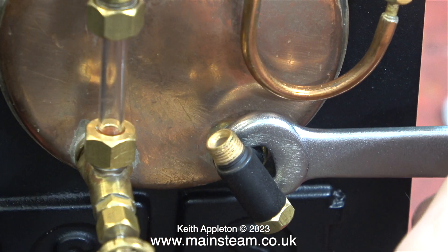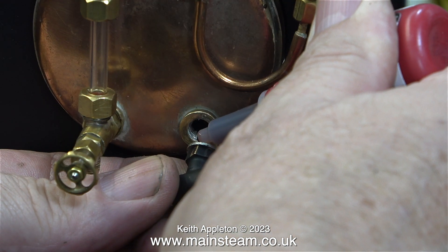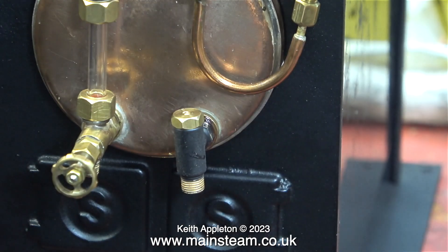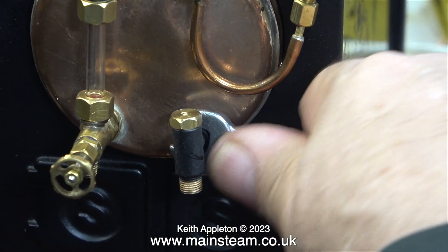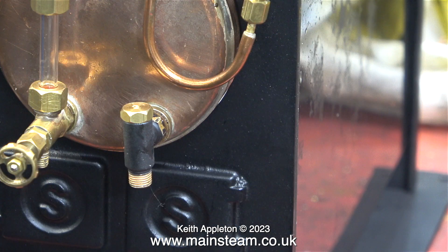I tried a test fit in the boiler using the new check valve but it didn't end up in the right position. Here's the hole in the boiler where the other check valve was and you can clearly see some remnants of the last Loctite 542 that I applied. In my box of shim washers I found a genuine Stuart quartering shim washer so I used that. I applied some Loctite 542 and tightened the part in place. Unfortunately the Loctite 542 is a really good paint remover, removing the paint from the hexagon part — I'll touch this in with some black paint when the job's a bit further on.